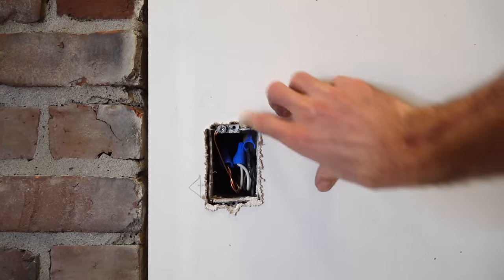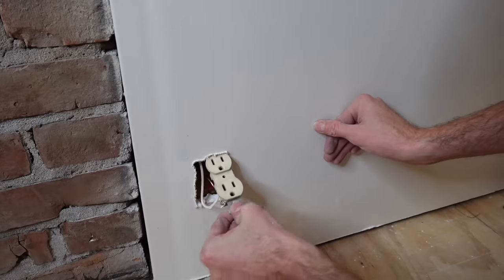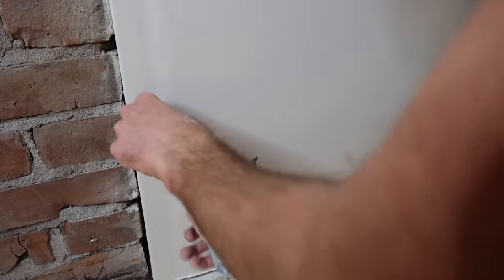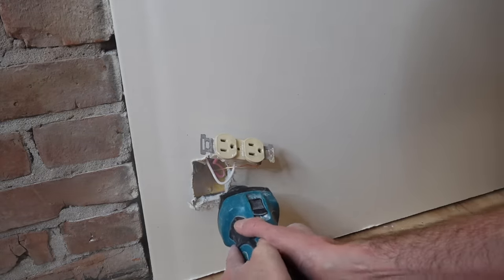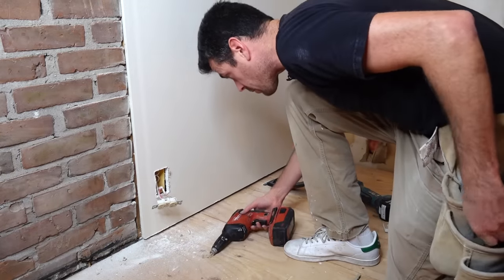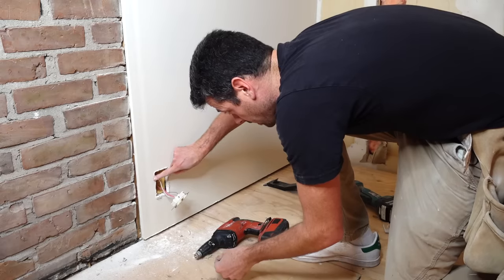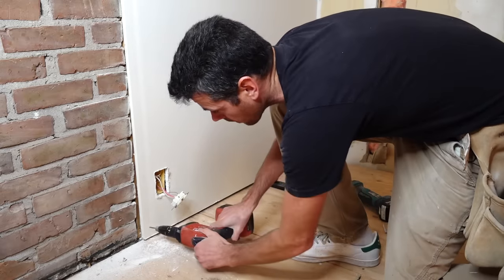The first router cut of the day was a little clumsy — I forgot it had both outlets right there. The next one is live, and I wouldn't recommend working with live plugs, but it's what I have here. I mentioned you could always just undercut them and knife the box out, but I'm going to router it. Another beginner mistake: screwing too close to the boxes. There are plastic tabs on these boxes that rest on the stud, and when you screw too close to them those plastic tabs cause the drywall to blow out.